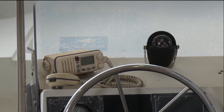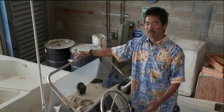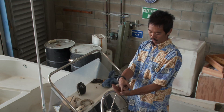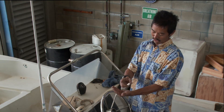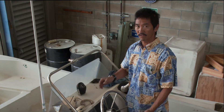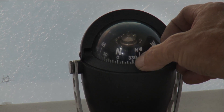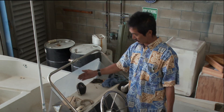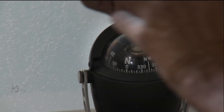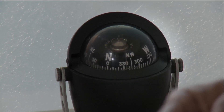How accurate is your compass? How do you read it? I was just talking to a young man the other day, and he deals with a hand-held compass. The hand-held compass has a needle that you line up with north, and then you look your direction which way it goes. A lot of boat compasses do not deal that way. They will have, generally, a card with a line that you read off of, and this line will give you the direction you're going instead of trying to get a needle to point to north. So as you're steering along, the card will rotate, and in relationship to the line is the direction that you are traveling.